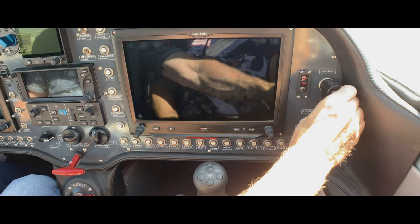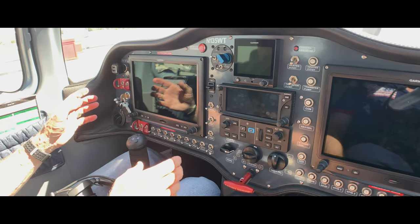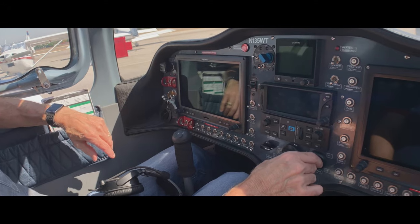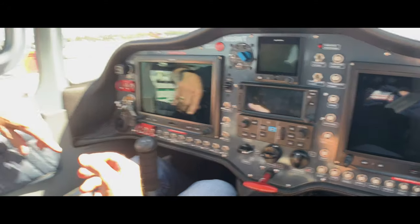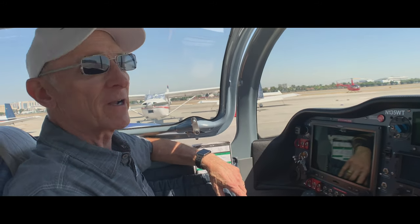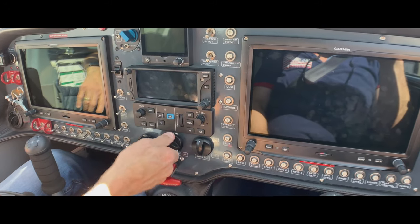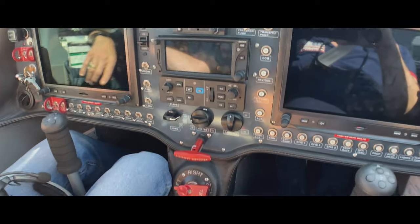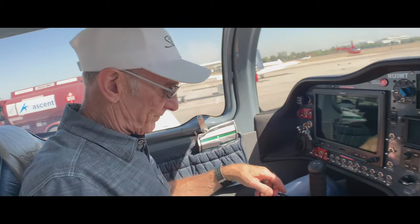There's a closed and open valve here for fresh air. And if it's cold outside and you want heat, then the heater controller is here. You close the outside vents and then it's all recirculated inside the cabin. There's a heat exchanger, like a little radiator, just like your car, with a 3-speed fan. And you go, and it's cool that way, hotter that way, which opens the valve that allows the coolant to flow through it. So it's kind of neat and less chance of carbon monoxide poisoning.